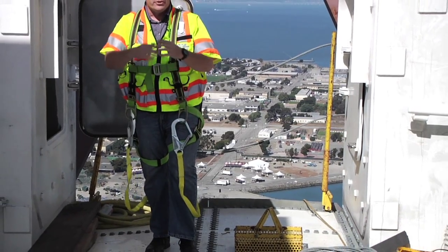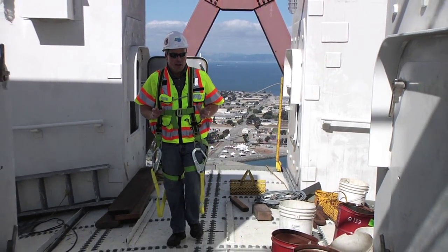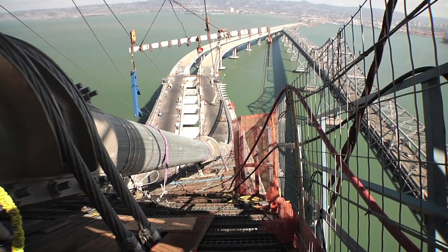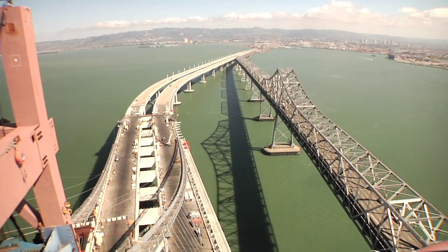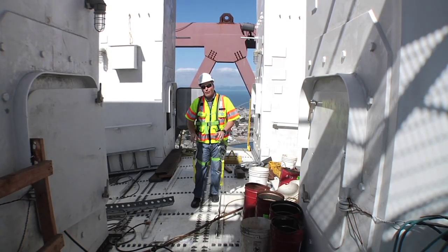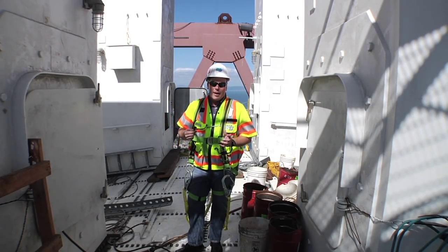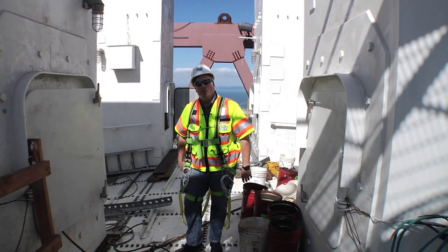That is one area where we use a dehumidifier to address potential corrosion issues. There are actually a total of five units on this bridge — that one is the smallest. We have two units on the eastern side of the bridge, one in each of the anchor points where the cable splays out, to keep it dry. Then we have another one 500 feet beneath my feet at the base of this tower, and one more at the very back end of the bridge where the cable wraps around. These are all areas where we don't have the wire wrap, so we use the dehumidification system to prevent corrosion.